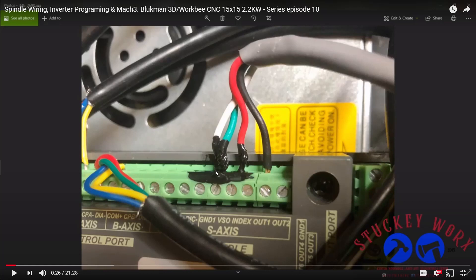There's no doubt in my mind that this end user knows this is not standard practice, because if you look anywhere online you will never see two leads using liquid electrical tape going inside a single terminal on an actual breakout board. These terminal blocks are designed for one lead. There is nowhere anywhere online that reflects this being done. This tells me that there's a sign of carelessness — this end user wanted to get the system up and running quickly, film a video quickly. When we don't take responsibility for what we're posting and we're not disclosing that what we're doing may not be best practice, we are disregarding recklessness in terms of what we're reflecting to other people as potentially incorrect practice to mimic. This is how misinformation online leads to more misinformation — it's a domino effect.